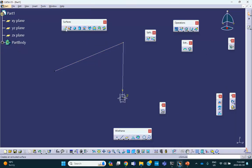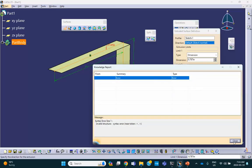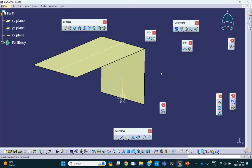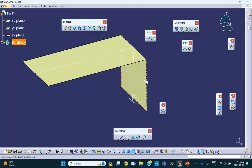This is the profile. Later on, I'm going to split that in the middle. Because of the way I've done it, this top face is connected to the bottom face, so when it comes to meshing I don't have to worry about it. But if you follow the book's approach, you have to join these — otherwise they won't see each other. Now on that top face, I will sketch a circle.